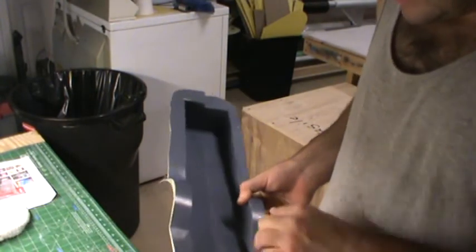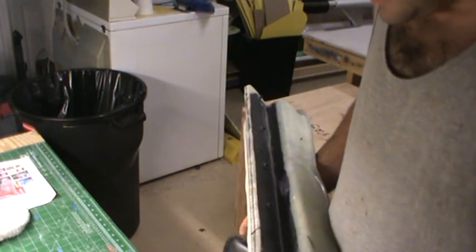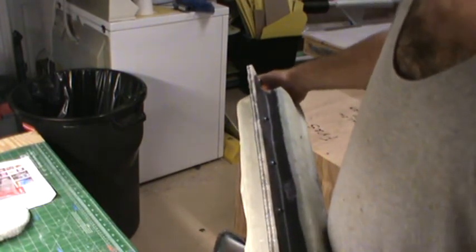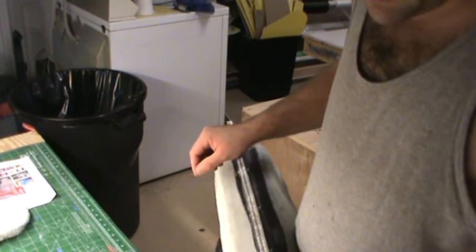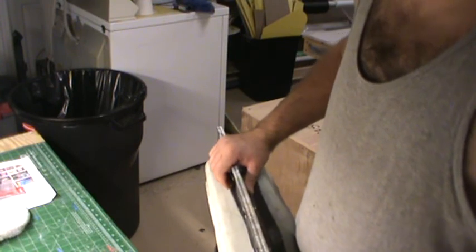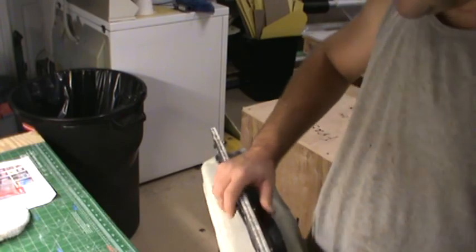Anyways, like I said, this is that carry-through box mold. I did a few things differently on this one. One, I used some carbon fiber just to add a little bit of strength here. Another thing is that core material I used in the Horton, that Aeromat or Soric XF2, whatever you want to call it. I put that down around the flanges, and you can see it built up that flange really quickly. I'm going to use this stuff more often for building up flange thicknesses. Yeah, this stuff soaks up a ton of resin, but man, this flange built up thickness quick. It's strong, it doesn't really compress, and it's cheap. So that's where I'm at with this thing.